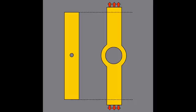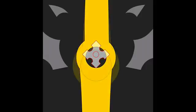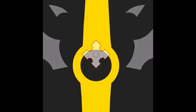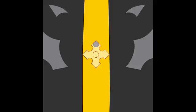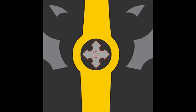So here you can see, stretching a hole in the strap causes the length of the strap to stretch in both directions due to the displacement of the brass. And because the section of the arm above the nuts had already been formed, that position was already set. Therefore, I estimated that as the hole began to stretch and get larger, the center point of the circle would move slightly lower than where it had started. To compensate, I drilled a small 1/8-inch hole slightly above the middle of where the screw would be. Then as I stretched the hole, the center of the hole would end up in the center of the arm.